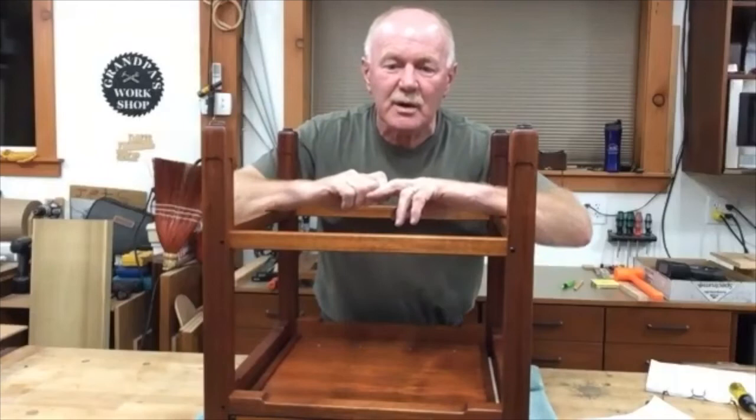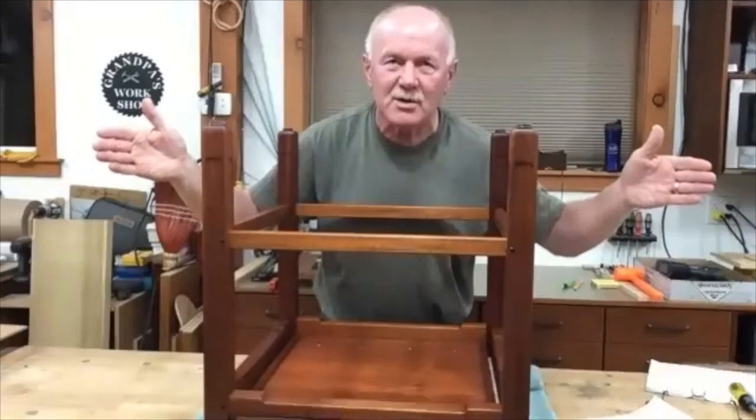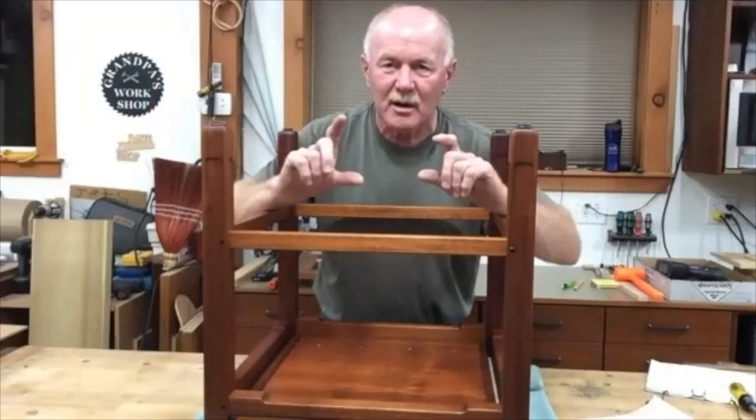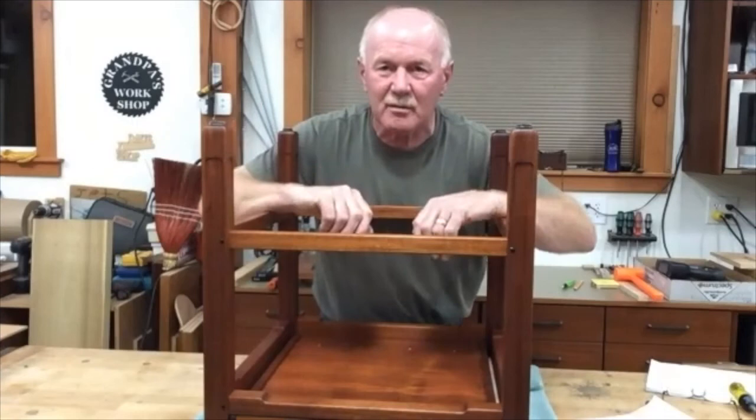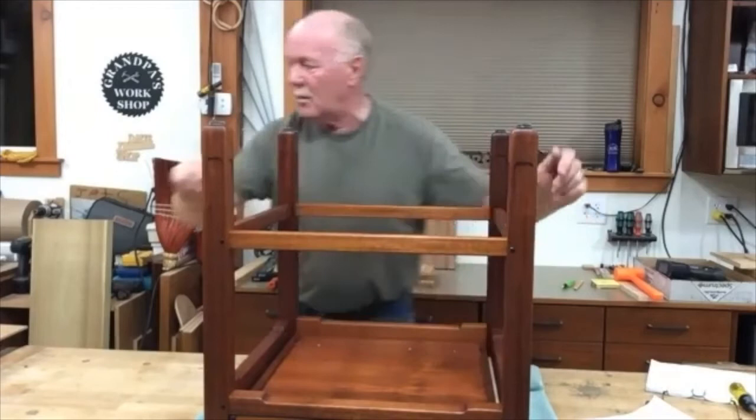So you need to get it down. But yes, you need to leave it over in length. Length only gets locked in when it comes time to do the joinery. Thickness and width are kind of right there at about that same time. But in terms of taking twist and warp and misshapen wood down, leave extra length on there until you've got it squared up. Yeah. Okay. Thank you.